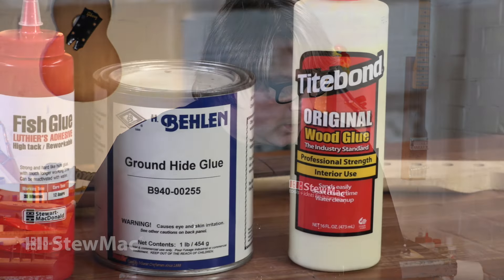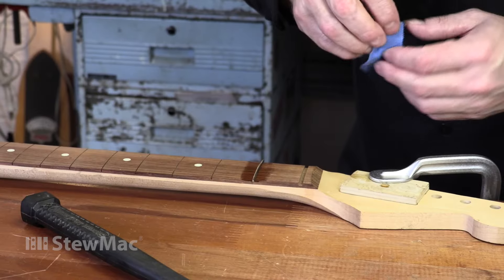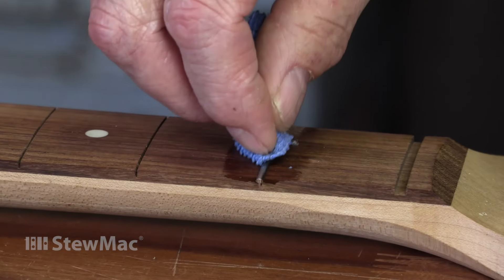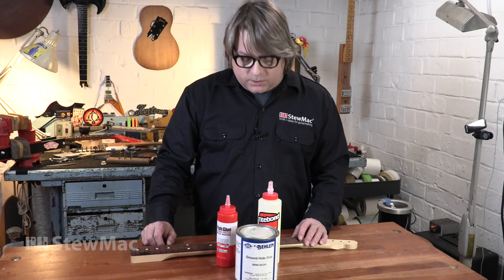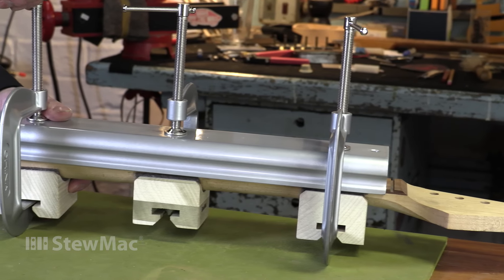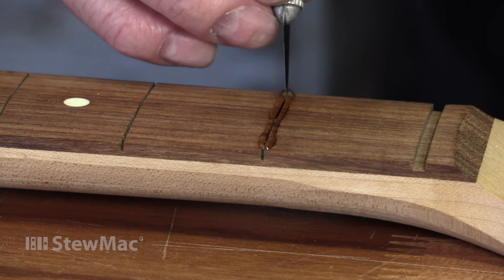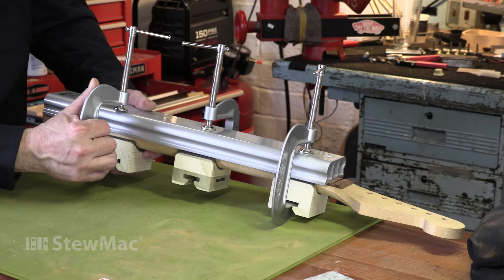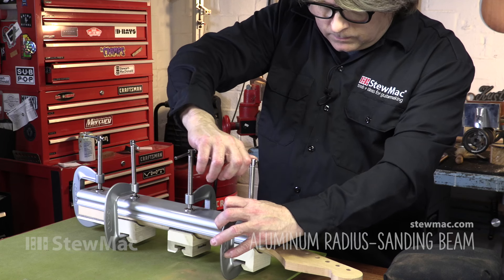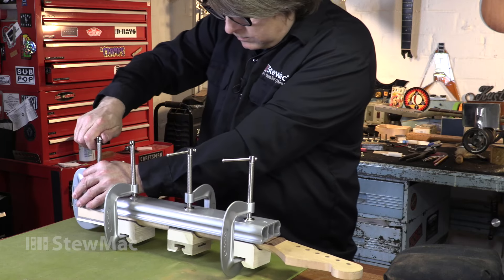Last, we're going to talk about water-soluble glues. They include things like original Titebond, fish glue, and ground hide glue. One thing in favor of using water-soluble glues is they're very easy to clean up — if you get squeeze out onto the fingerboard or coming out the sides of the slots, just a little bit of warm water and you clean it right up. One of the downsides is you will need to clamp these frets to allow them to cure overnight. The water-soluble glues can be a little slippery, so even though you seat the fret really nicely, by the time you make your way down to the end of the neck, it might kind of pop up out of the slot. So to ensure they stay totally seated, you'll want to clamp them down with a radius block or rods and let them sit overnight. It's not going to be a fast fret job.